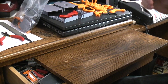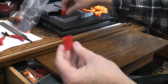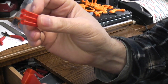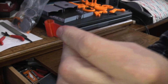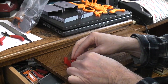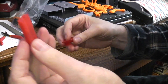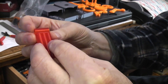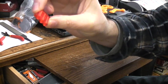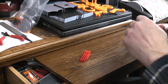There are a few sub-assemblies that you can do to have ready ahead of time. One of them would be this — a ratchet, a wind-up ratchet — and attached to it will be these gun barrels, which I printed in translucent red. This part prints in this position, and the gun barrels print flat, so they're able to print without any supports.